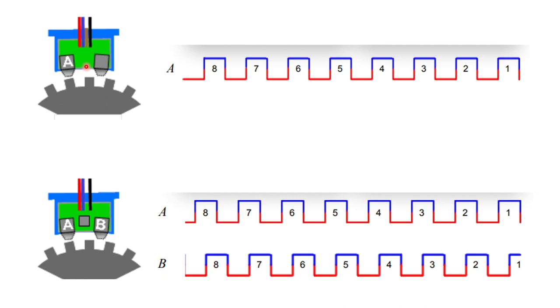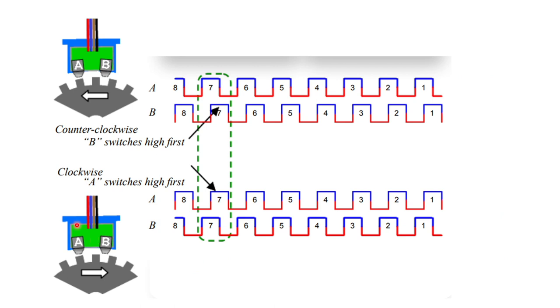So far we discussed a single speed sensor, which can be used to calculate speed. But if we use two speed sensors, that can be used to calculate speed as well as direction. In the case of a single sensor you have pulses generated on one channel. With two sensors, if signal A switches first and B switches second, that means the wheel is rotating in the clockwise direction. If the B pulse is leading and A is following, that means the wheel is rotating in the other direction.